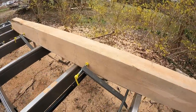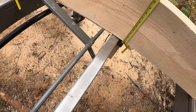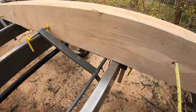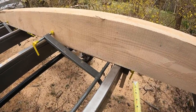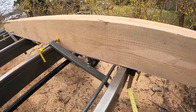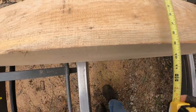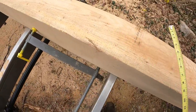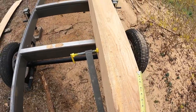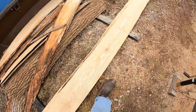I was taking some wide cuts in the beginning there, but they're going to be about ten and a half inches or so. What I'm shooting for — for my ship lap or tongue and groove, whatever I decide to do — is probably about six-inch wide slats to eliminate warpage. I don't want to attempt a 10-inch wide board. Now I have about seven inches going down roughly, so by the time I trim them up they should be right about six inches. I'm aiming for five and a half to six inch wide boards, so these ones are going to have to get ripped down on the table saw anyway.